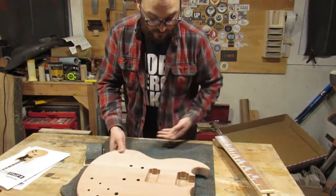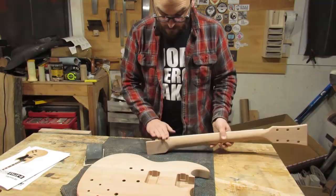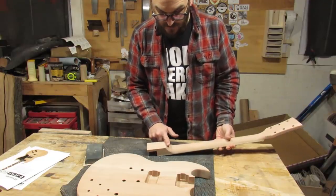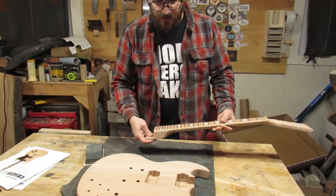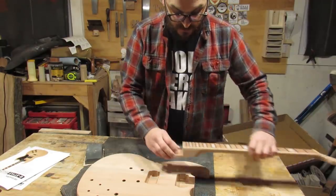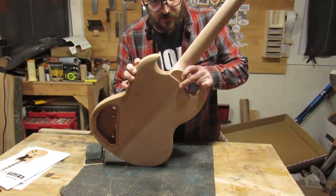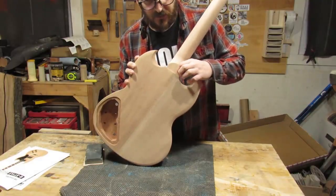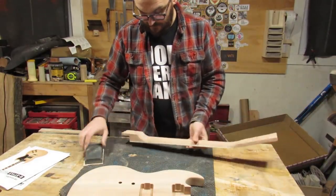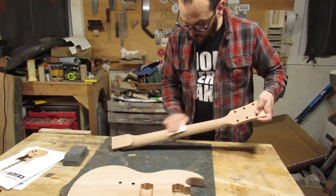I'm going to continue sanding off camera, because this is boring. I'm also going to sand the neck. But this is probably pretty important: don't sand the neck joint area — here, here, or here. This neck pocket needs to be flat, and this heel surface needs to be flat too, because this is a glued-in neck, not a bolt-on. So leave the joint area alone. Just sand the parts that are going to be exposed. I'll probably sand it again once it's together to make the transition as nice as possible. On the round part of the neck, I'm going to do it by hand so my hand can follow the contour a lot better.